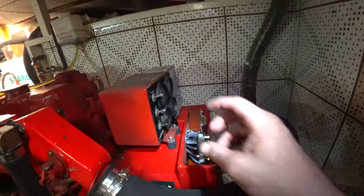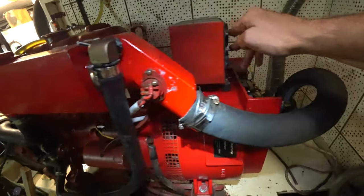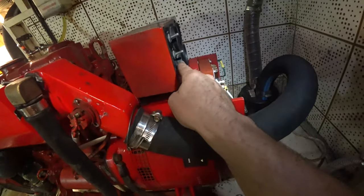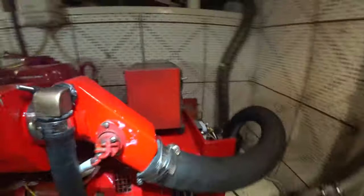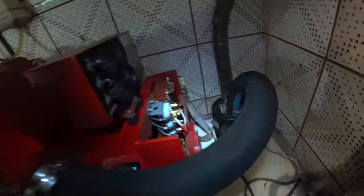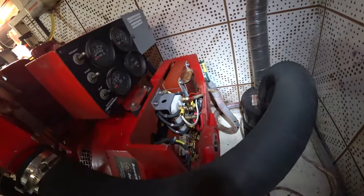I foolishly thought that's just how it should be now because they did all the new wiring. Rather than doing the smart thing and calling down to Broward Armature to double check, I went ahead and started the generator, which ended up frying my voltage regulator. That necessitated taking the back end off again, taking it back down to Broward Armature to repair the voltage regulator—which cost another $1,200 to $1,400—all because I didn't take five minutes to call. So do not be like me. Do the right thing and double check.